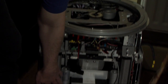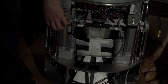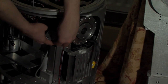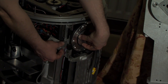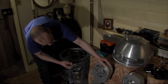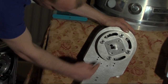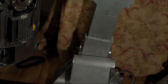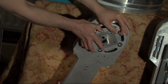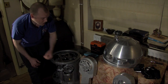The 2-3-2 is the two leg to three leg conversion. The actuators drive these arms. These arms push this central plate, which is on a bearing. As that turns, these stay with the body and this moves with the leg. Connected to here, off a little foot, is a bar going to the ankle — and that keeps the ankle locked in. So for example there it's all solid, and this end it's all solid. That allows him to stand in two leg mode, otherwise he'd just be free to fall over when he went back to three legs.